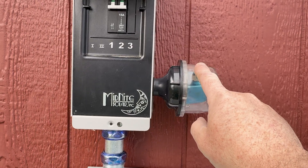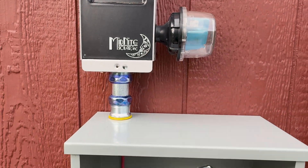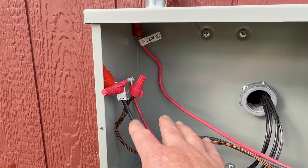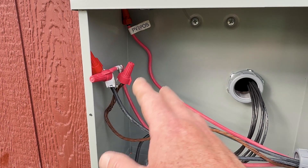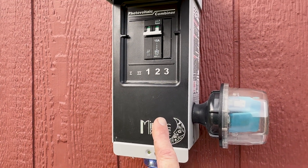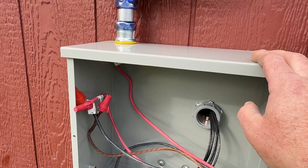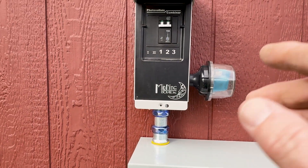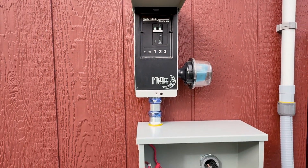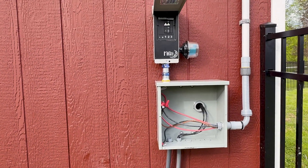Still need to upgrade my lightning arrester — this one is 150 volt. I have a 300-volt inside; I'm just waiting to do all the wiring in here. On my solar lines, I'm going to put MC4 connectors on these — I'll wait until it's dark so there's no voltage — and run up to the disconnect here, then back down through the shed into another disconnect inside, and then to the inverter. So this is not a combiner anymore; it's just going to be a disconnect. Just some infrastructure upgrades for the off-grid shed.